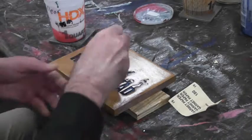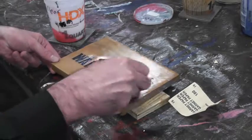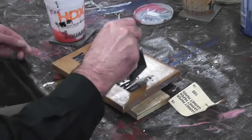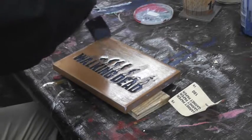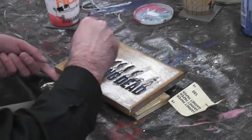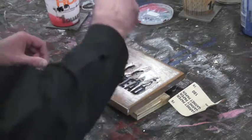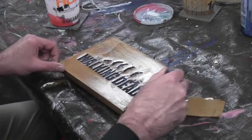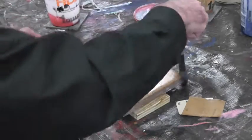I'm going to start soaking the ends and edges to even things out and get rid of the excess. If you soak your brush, you can't do this — if your brush is already saturated with clear finish, it's not going to soak up anymore and you won't be able to even it out, and you're going to make a complete mess.